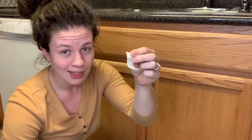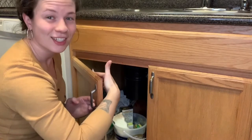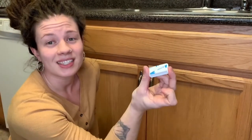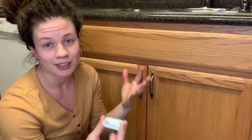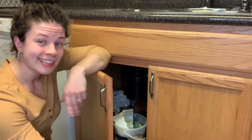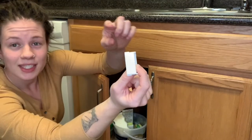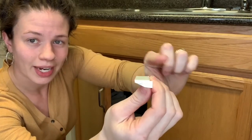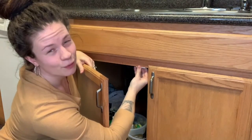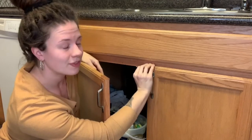First, take the alcohol swab provided and wipe off the surface where both the strike plate and the lock are going to go. You want to make sure that the place where your 3M adhesive is going to stick is free of dirt and debris — so it's attaching to the cabinet and not to grime on top of it. Once the area is clean, take your strike plate, remove the 3M adhesive cover, and with the adhesive pointing up and the nose of the triangle shape pointing out towards you, place the striker flush to the front of the cabinet face frame. Press and hold the piece into place for 15 to 20 seconds.